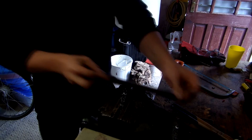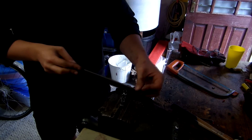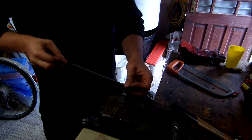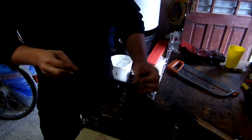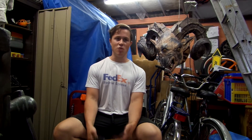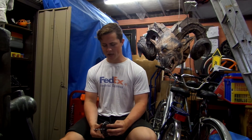Depending on how it's gone, you may need to go back to the drill press and drill a few a little bit deeper. It's really important that everything is symmetrical and all the blades are equal depth and equal size, because if there's an imbalance - particularly in a jet engine - it needs to be really well balanced, otherwise you're going to have vibrations and it could rattle itself apart. Once cleaned up with the file, you'll need to make the sharp edges on the blade, which are a really important part of the fluid dynamics - they need to be sharpened.